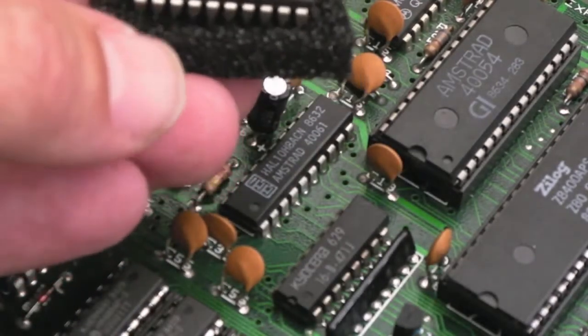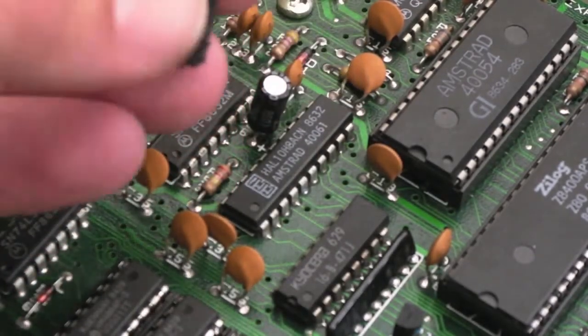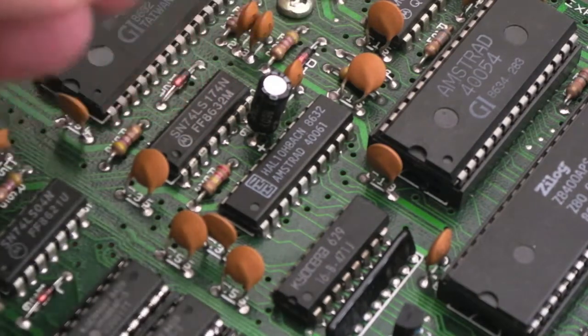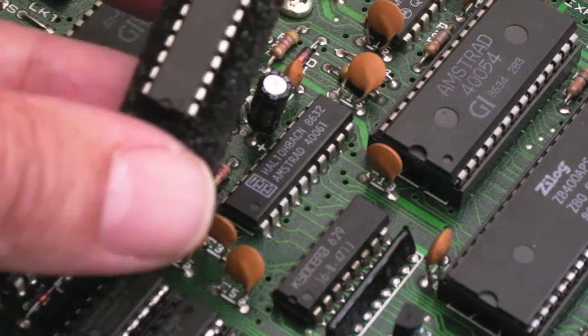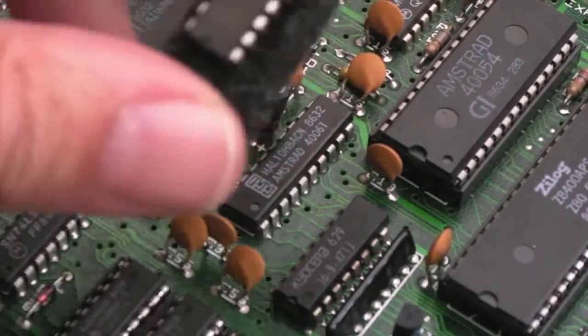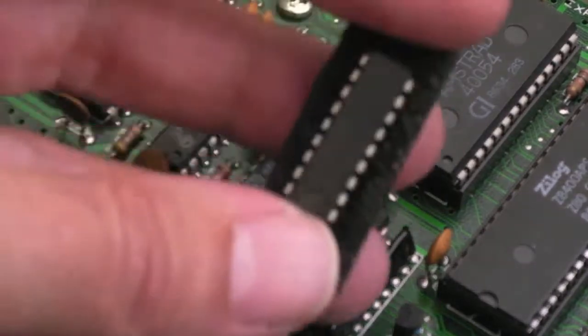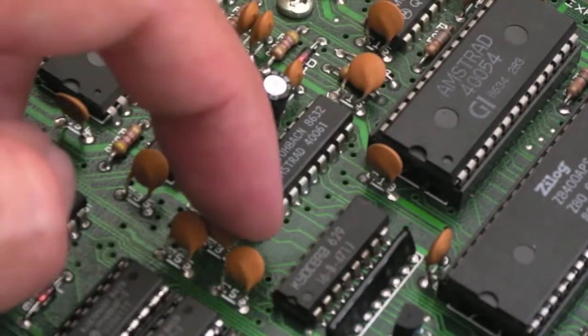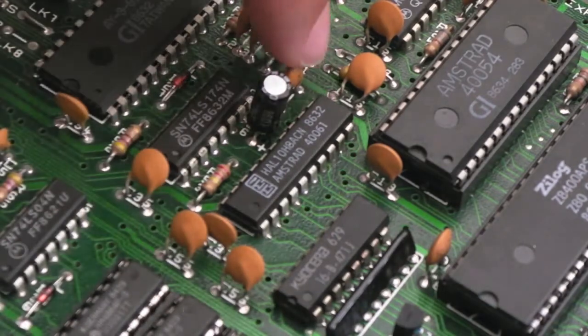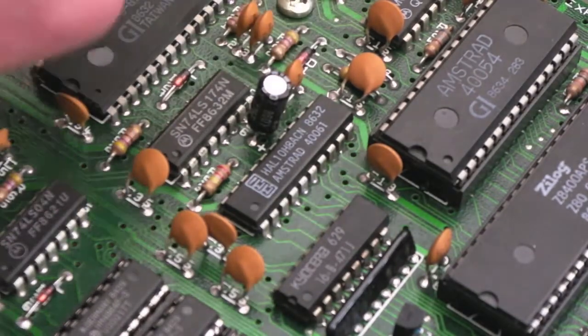What's impressive about this, really? Well, I guess it's not that impressive, but I think it's pretty good that the person who's done this identified the fix. It's pretty straightforward. You have to replace the chip, obviously. There's just one wire, and the wire goes to one of the pins that was previously unused. I think it's one of the bottom corner pins. I forget which one it is. I think it's probably this top left pin here that is not used.